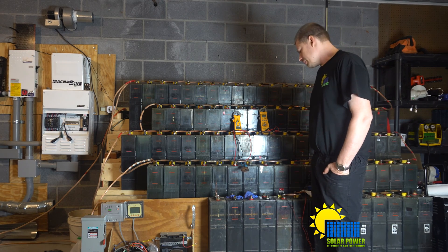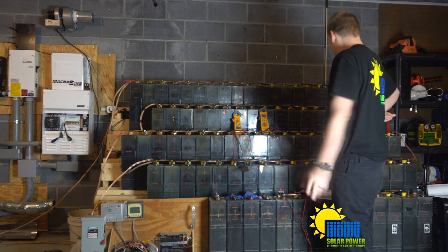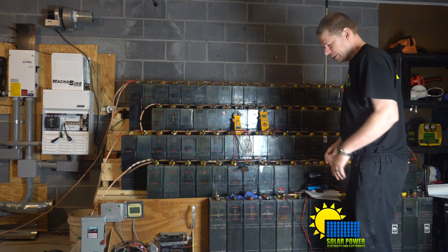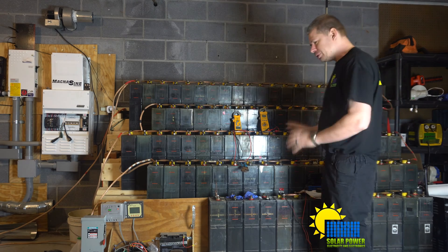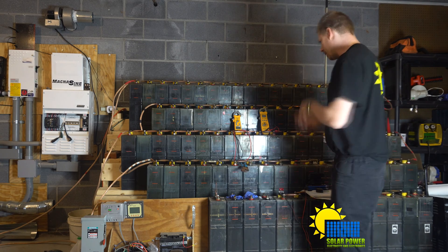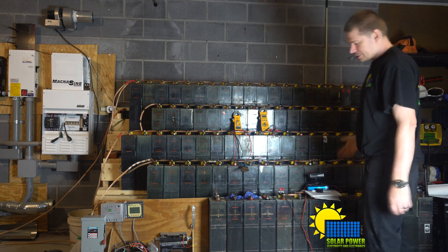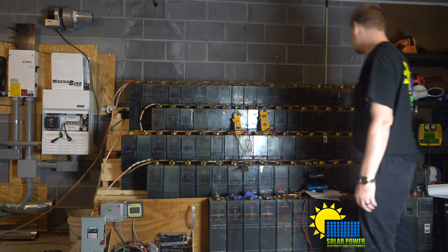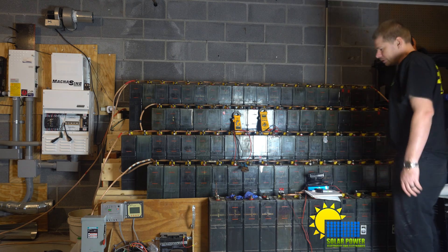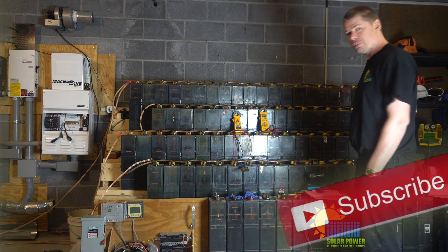I just think they need potassium hydroxide. It's five o'clock in the morning and the power went out tonight because I was making videos — I ran it down really low. I've been monitoring this to show you what happens: the power goes out, and that cleaned battery is kicking butt while these two bad batteries aren't doing well at all. The rest of the battery bank is just limping along, but these two have basically had a stroke — they're at zero volts right now.